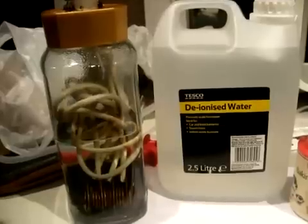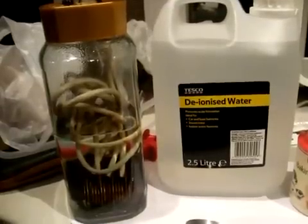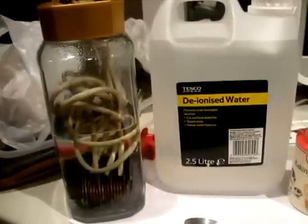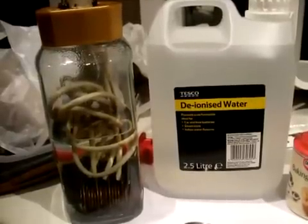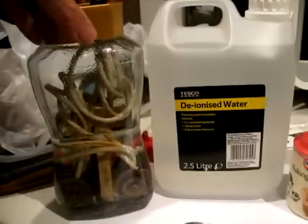This is the new modified jar with completely soldered cables from the lid connection terminal, soldered right the way down to the washers. There is pressure contact at the washer end, and to make a good contact from the soldered cable to the washers, just tighten the nut and bolt together on the cell. I have used some cat 5 cable outer sleeve, stripped it back and slipped the sleeve over the soldered cable so as to prevent any chance of shorting in the vessel.